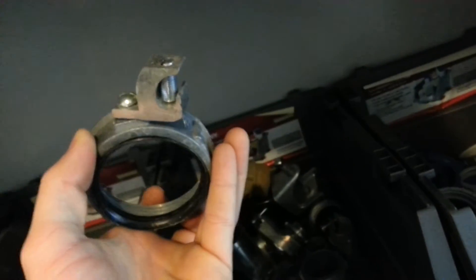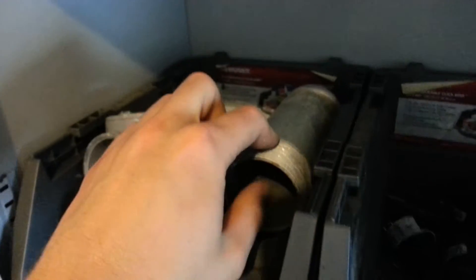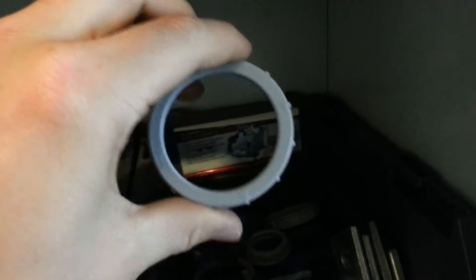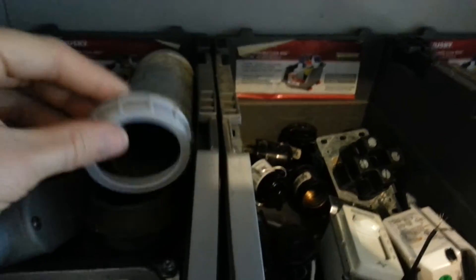This is what is known as a grounding bushing. It's like a plastic bushing except you run your ground wire through there — it would go on the nipple like that. Wrong sizes here, but you get the idea: you can run your ground wire through there and that will ensure your rigid nipple is grounded. Here are some more chase nipples. This is a Romex connector for putting Romex through. Here I have some plastic bushings. These are Unistrut L's for working with Unistrut — we'll get more into Unistrut later on. Plastic bushings thread onto the rigid nipples in the panels so you don't scrape your wires going across them.